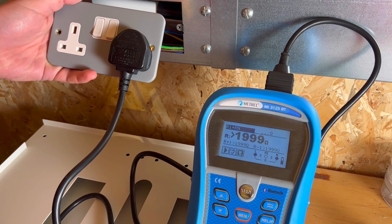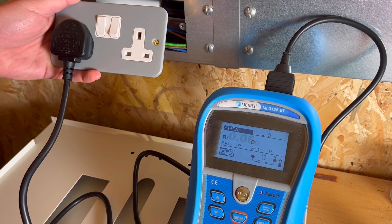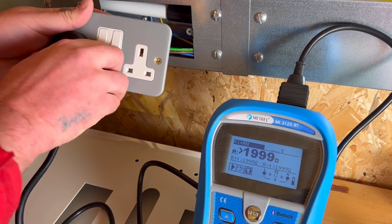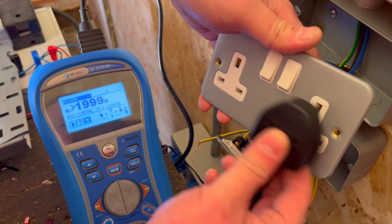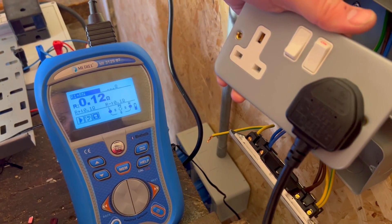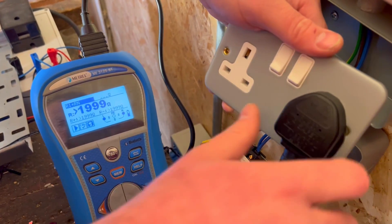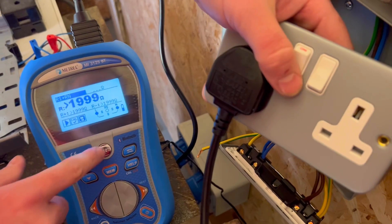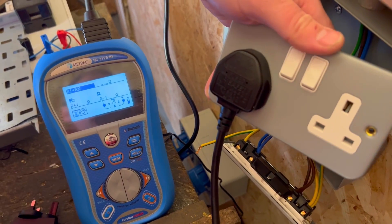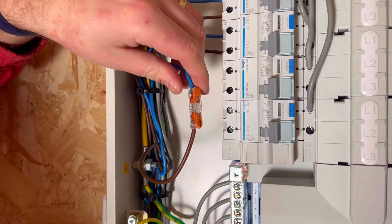We go in, take a reading, operate the switch, prove the switch works, and check both sides — remembering we'd expect a very similar reading on both sides. We work our way through all the sockets and now show the last point. At the furthest socket we get a reading of 0.12 ohms. We check the switch and also check the other side. We know this is the last point on the radial circuit because there's only one line, neutral, and circuit protective conductor in the back of the outlet itself. That reading is not recorded — it's just part of the polarity check.